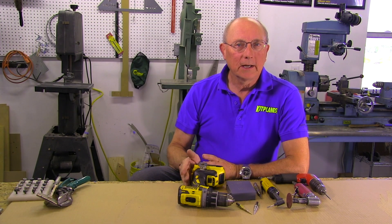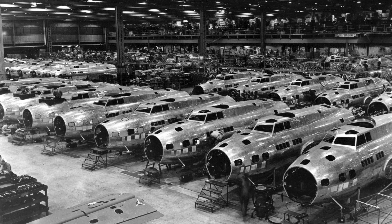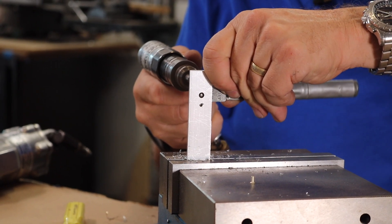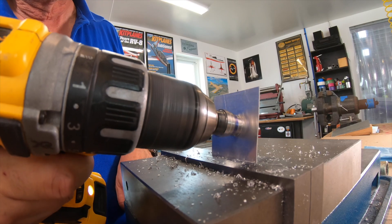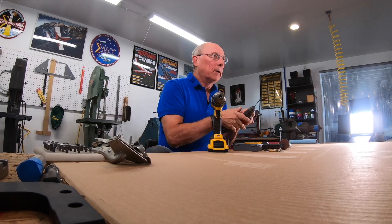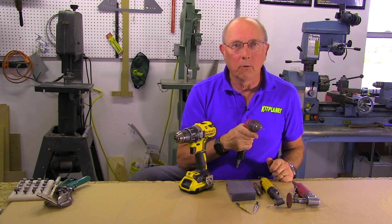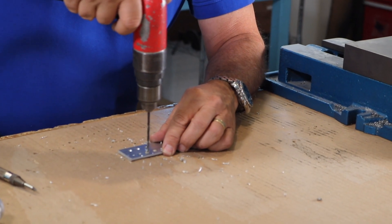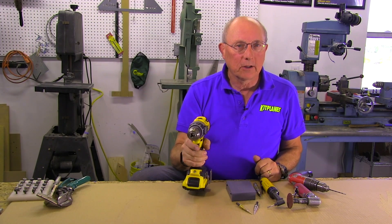Let's start talking about what it takes to drill holes. You need some sort of a drill motor. Traditionally, airplanes are built with air drills because we want very high speeds for drilling aluminum. Nowadays, electric drills can give you those same high speeds, so it's really up to you depending on how much noise you want and how easy it is to work with. In our shop, we have a couple of air drills with the common sizes already installed and they just live that way — if I need a number 30, I grab the red drill and hook it up to an air hose. If I'm going to be doing a lot of bit changing, I'll use the electric drill because it has a quick-change chuck.